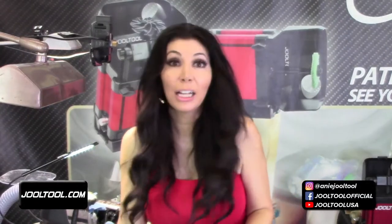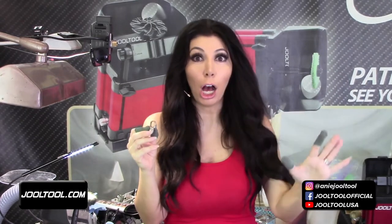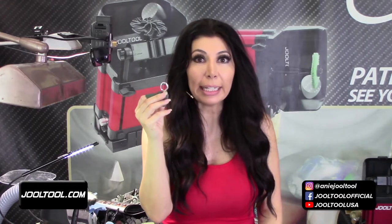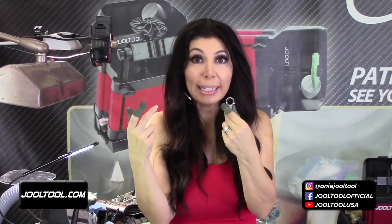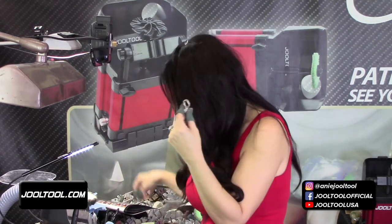Pretty cool, huh, guys? When I show this to manufacturers, like in Hong Kong or Mumbai, who have thousands of employees, and I say, this is how fast you can clean a casting, they don't even see Anie anymore. I look like one big dollar sign to them. That's the money that they save. Because number one, they're saving on the gold or silver because they're not losing material. Number two, they don't have to stop if they get a hole of porosity. They don't have to stop and go laser weld it or try to hammer it out. The scratch eraser, hello, my friend, will do it for you.